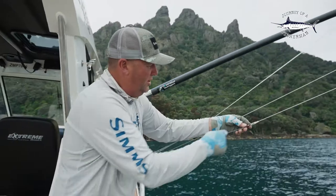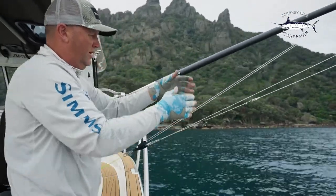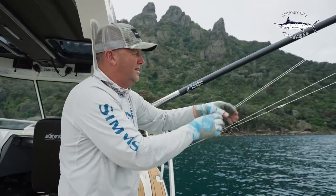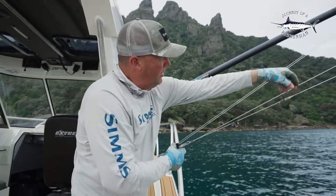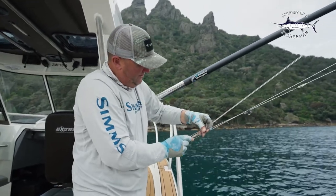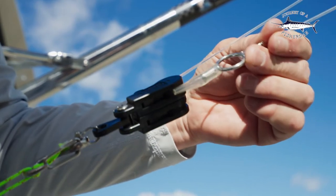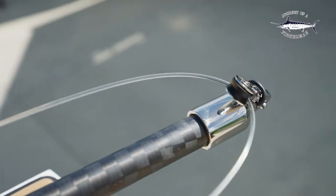When you go to put this on, you can adjust the tension to get your halyard lines right. It's really important when you put your riggers out to get them adjusted so you've got the same amount of tension - no use having one tight and one loose, you want them about the same. Once you've got the right tension, on the top and bottom of the sacrificial piece of line we have a little rubber sleeve that goes over the crimp to protect the pulley when you're bringing your halyard down. We also have one on the top crimp so it doesn't go into the bearing pulley at the top of your outrigger poles.